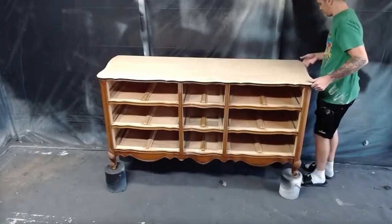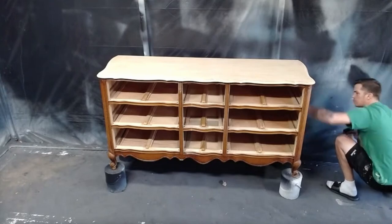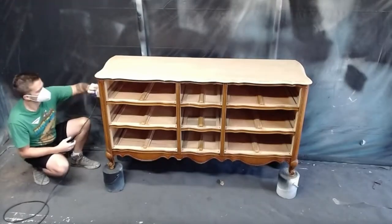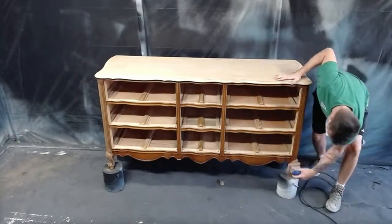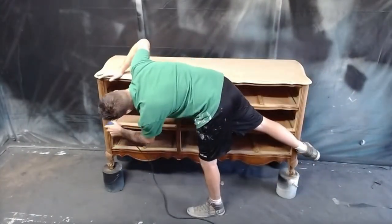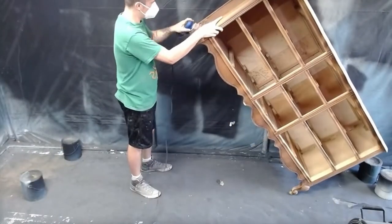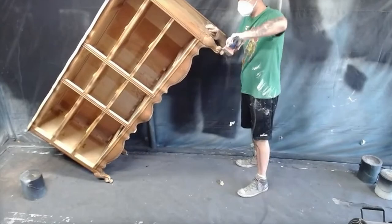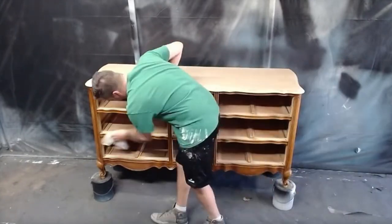With all of my stripping done, I can move on to prepping this piece to get it ready for paint. To get my surface nice and clean, I used some trisodium phosphate in a spray bottle — just give it a little spray and wipe it down and it's clean and ready to go. Once everything is cleaned, I used my Surf Prep 3x4 detail sander and some fine sandpaper to give everything a light sanding. I'm not trying to sand this down to the wood; I'm just trying to scuff up the original finish so that our paint has something to adhere to. Once I'm done sanding, I dust everything off and then give it a wipe down with a damp rag to make sure there's nothing left behind.